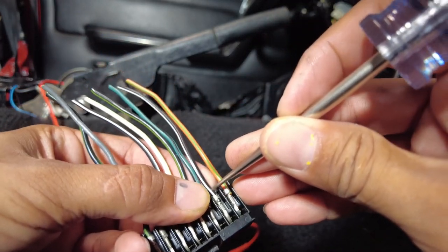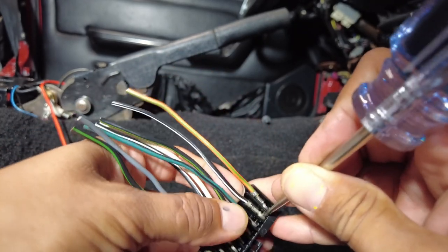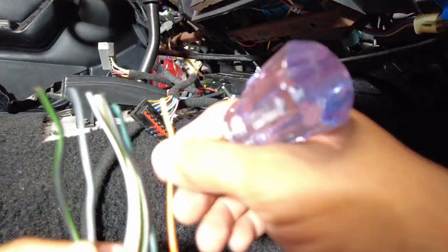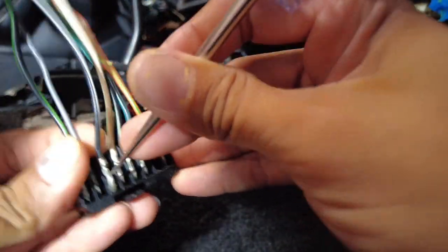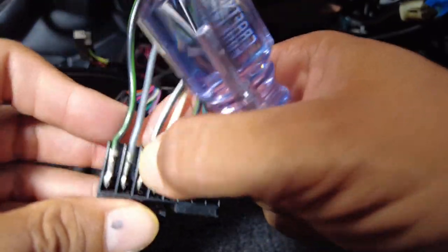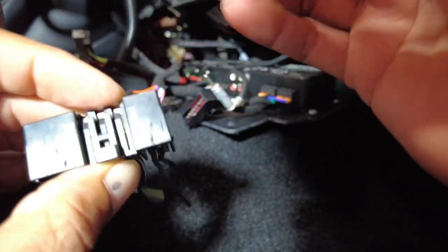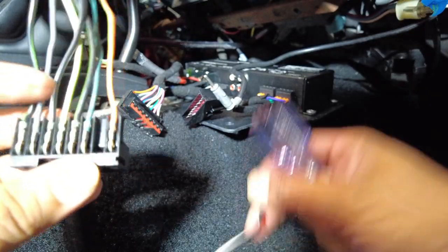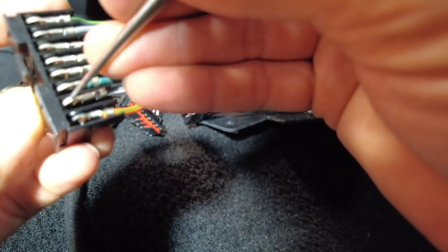So let's say we want to move this pin — this black one. We're going to touch on the bottom like that, and as we're touching, we're going to pull back with our other finger, and the pin is out. Same procedure for another pin: press down, pull back, and the pin's out. Now to get your pin back in, all you have to do is push it in and you're going to hear a satisfying click. If you don't hear a satisfying click, it's because you pressed too hard on your plastic — just give your plastic a push back. Make sure the plastic is pushed back before pushing the pin in, and you'll get a satisfying click.